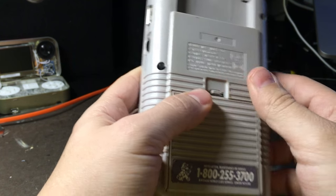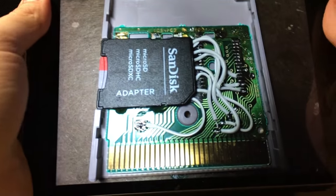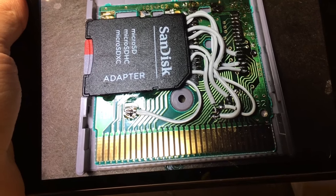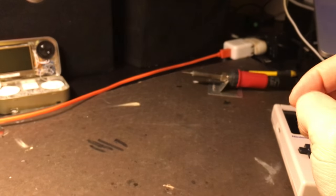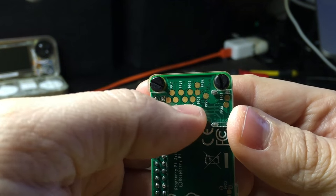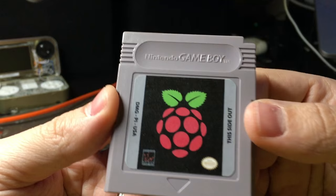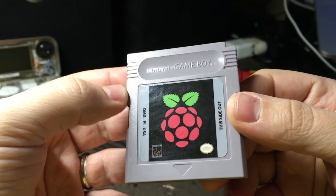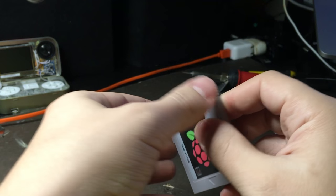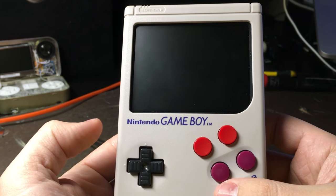But I think my favorite feature: I took an original Game Boy cartridge, took it apart, and I wired up an SD to micro SD card adapter. I desoldered all the chips and soldered it up to some of the pins. Then I took the cartridge reader from the Game Boy and wired up those pins to the SD card pads on the back of the Raspberry Pi Zero. So what that gave me is a custom Game Boy cartridge that acts as an SD card adapter — I can take my SD card, which has RetroPie on it, put it in the cartridge, put it in my Game Boy, and there we go.